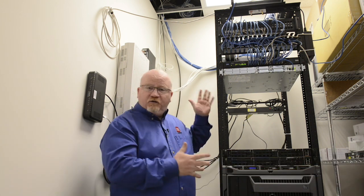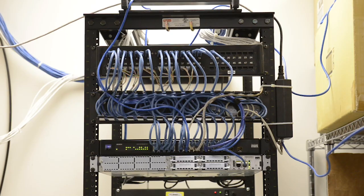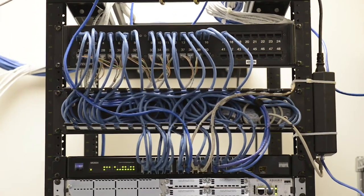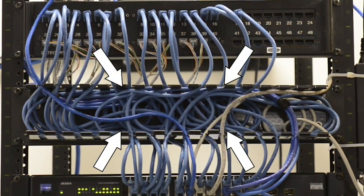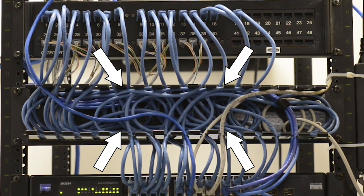There are a lot of different pieces on my equipment rack, so let's take a look at them starting up at the top. The first thing I want you to notice is my patch panel. The back of that patch panel has 110 punchdowns, and you can actually see the blue and white cables that are coming from the top — those are all terminated into the back of my patch panel. Scrolling down just a little bit, that is cable management. I push the patch cables into that little area there — it's just a convenient way to keep things a little bit neater.